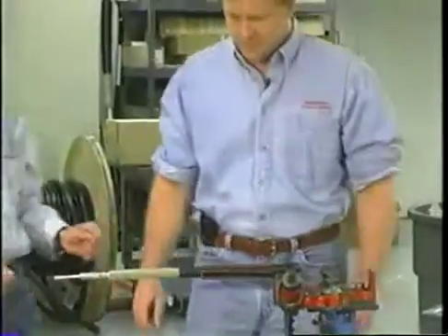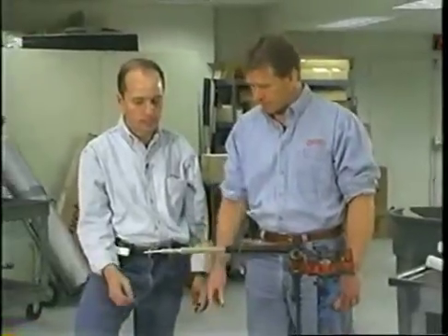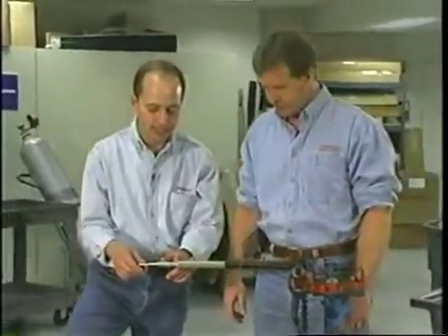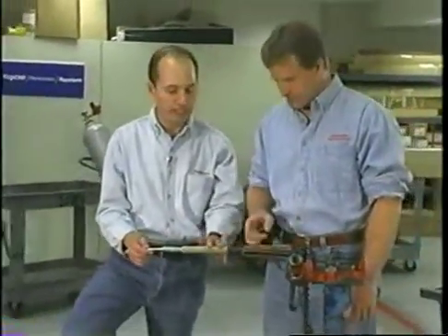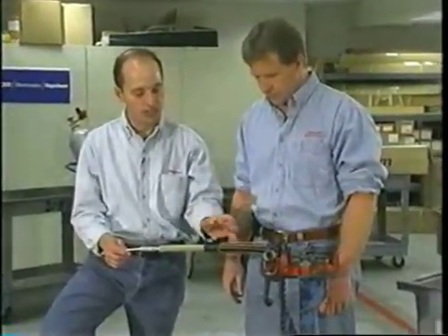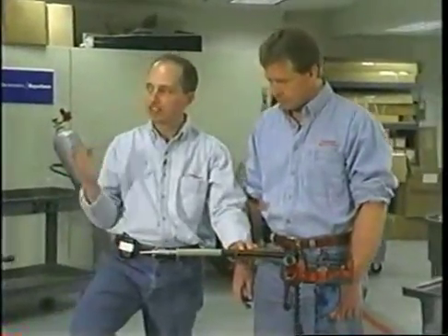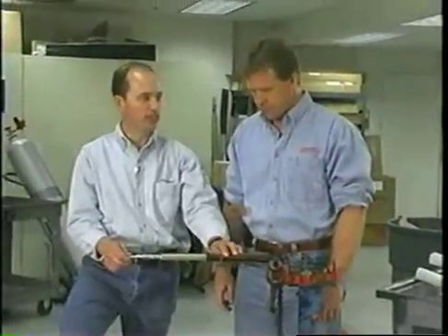So Harry, what do we got here? This is a cross-linked polyethylene insulated aluminum cable. So this is the kind of cable that most utilities use in the United States. I see an aluminum conductor, cross-linked polyethylene or XLPE, semi-con, and jacketed concentric neutral wires. And these neutral wires are large and they're kind of bulky. This is the kind of termination that is used outside, and usually is not done with a heat shrink termination. Is that correct?